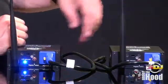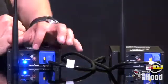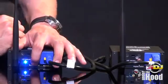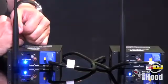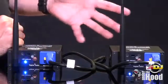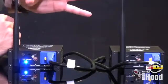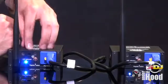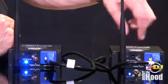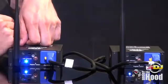Here's the front of the transmitter and receiver. You'll see it has a nice locking IEC power cable, your antenna, and blue LEDs. When they're solid, that means they're not sending or receiving DMX. If you push it and see it flashing fast, that means it's searching for the receiver. When it is receiving DMX, you'll have a slow flashing light. Right now the receiver is flashing slow because it is synced up to the transmitter, but the transmitter is not sending out DMX.